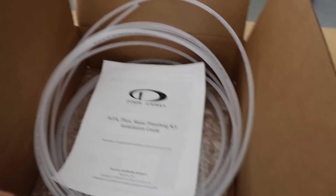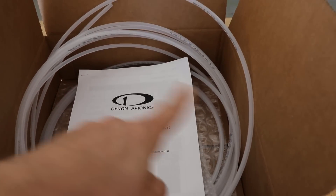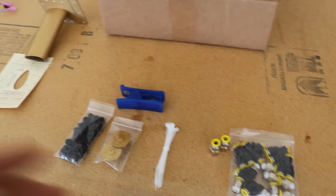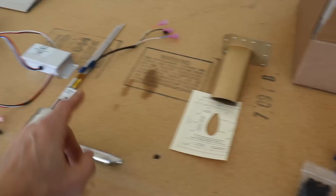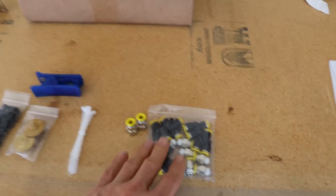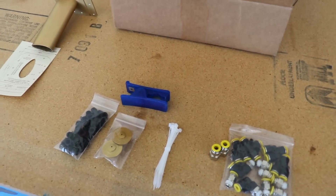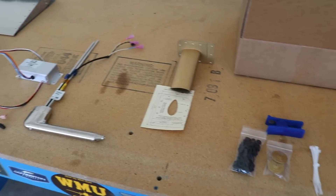The kit has clear tubing for the static lines, and then there's a blue and a green one for the wing — they're all exactly the same but different colors. I'm going to make my Super Duty IFR capable. That's one of the reasons I have a heated pitot tube. I don't know yet if I will have dual AHARs, but if you do, I think you have to split off your pitot static lines to go into both AHARs. So this has all the connections I would need for that.